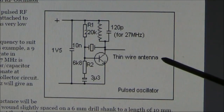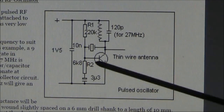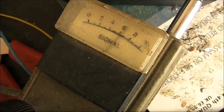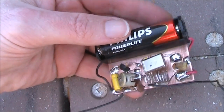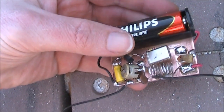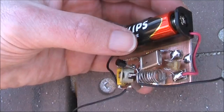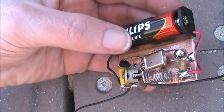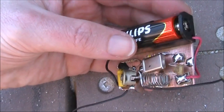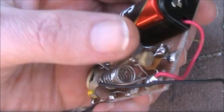Designed for 27 to 29 MHz, it's a super simple, very elegant circuit, using a resistor in series with an electrolytic capacitor to do the CW pulsing. This is my version, very similar to the one in the EMDRC bulletin, except I've changed the frequency a little bit — it's using a crystal on 36.864 MHz. It's an off-the-shelf crystal, and it happens to be in a part of the band dedicated to low-power transmitters, at least here in Australia. Added is a light-dependent resistor, which shuts the unit off when it's in the dark.